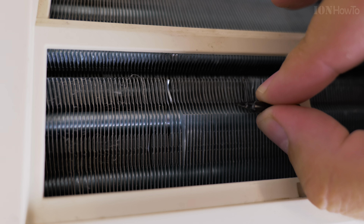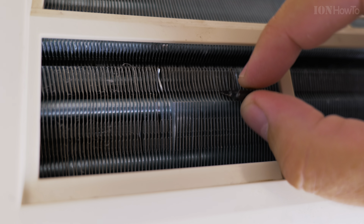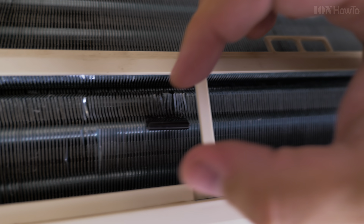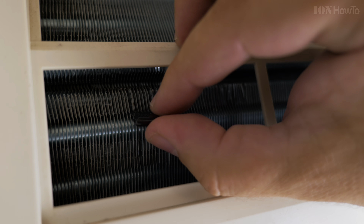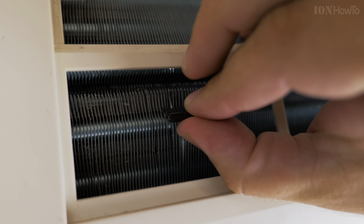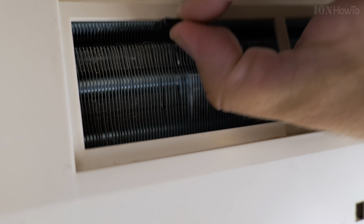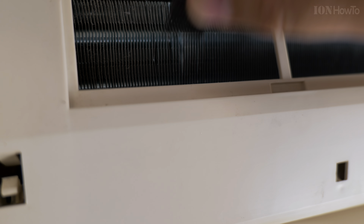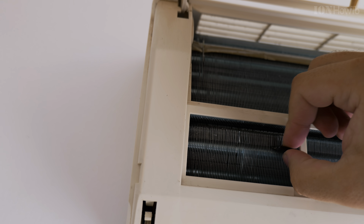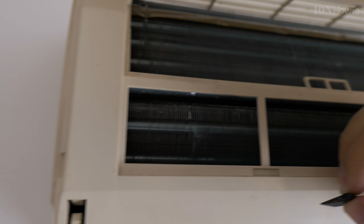Inserting at the base where they are straight, next to the heat exchanging pipe, and pull upwards. Lift it up each time, making sure not to press the comb onto the fins to make them worse. If the comb goes in between the fins it's really working - it's much more difficult to do it otherwise.